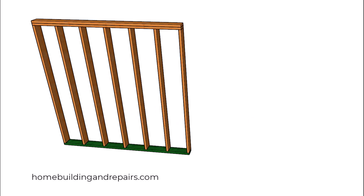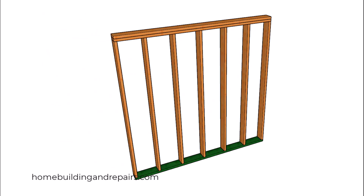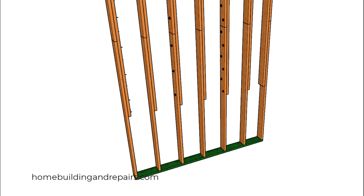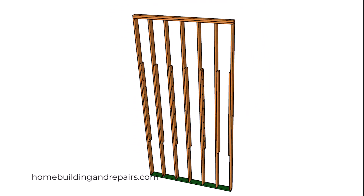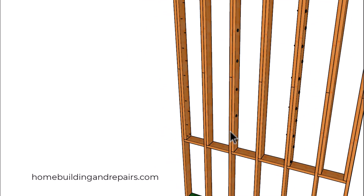In this video I will be providing you with a method you might be able to use in your area, especially if you can't find longer lumber and you need to build some taller walls. That would be to simply use the lumber you have available and lap it or sister frame it. The block installation should make this wall a little stronger.